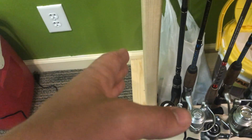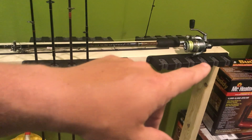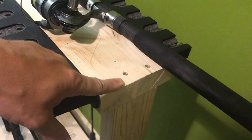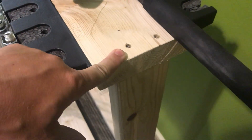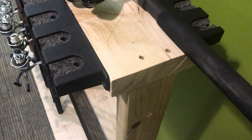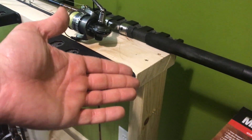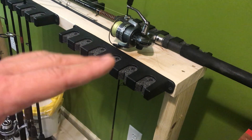Once you get those together — so I did that upright, that upright — I simply centered this one. As you can see, it overhangs. One thing I did forget to say: you will need screws. I use deck screws — they're a little excessive, but they won't rot and they'll never rust on me. You need a box of screws. These are 2x4s, so you can get away with a 1.5-inch screw, but I wanted it nice and solid, so I used 3-inch deck screws. That's something to pay attention to.